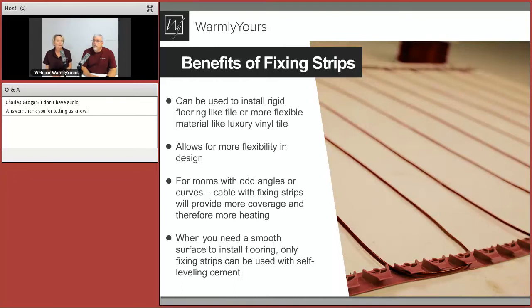It's always recommended to insulate from the slab — we were the first company to really raise awareness that heat gets sucked away when placed directly on concrete. You have to ask yourself: do you want your floor to feel warm, or just not be cold? There's nothing more frustrating than going to all the trouble of putting in a heated floor and then when it's 12 degrees outside, your floor is only 74 degrees. Once your foot touches a warm floor, you never want to touch a cold floor again.